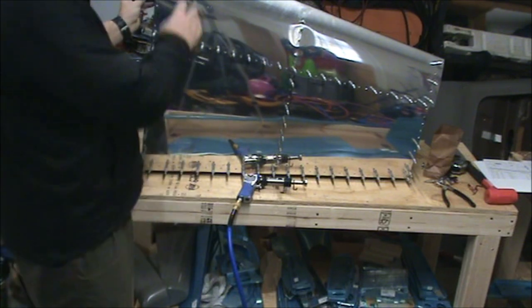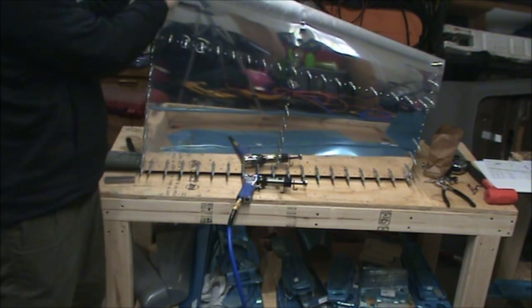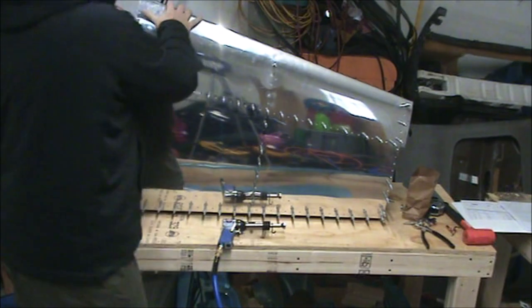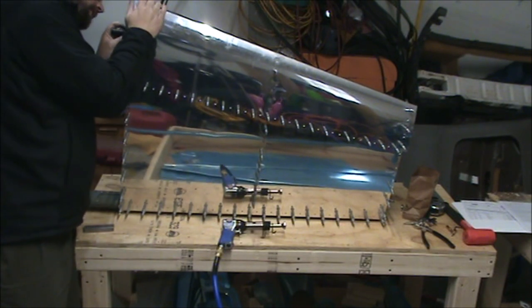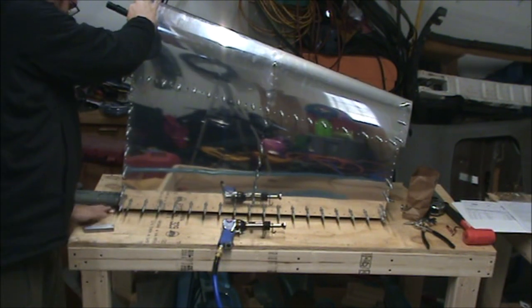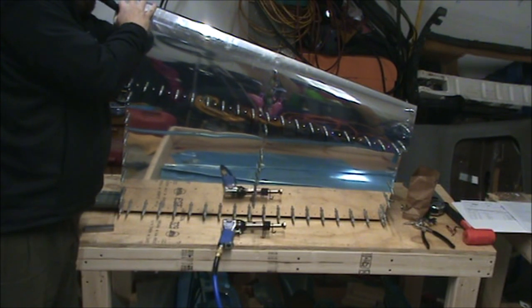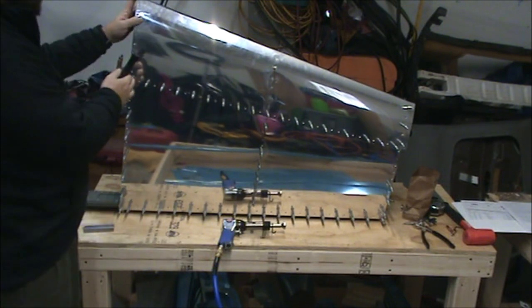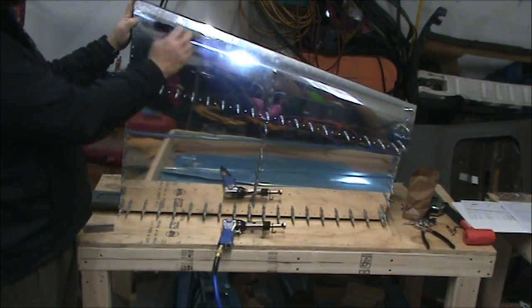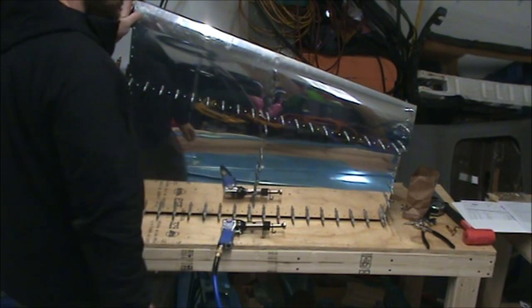This is probably just off screen since I have this standing up. We'll adjust it up here just a little bit. What you've missed me doing between each rivet set, probably because I was a little bit too low on the camera, is looking in there, making sure the rivet's set correctly and putting a rivet gauge on there, making sure they're not under or over driven, because once you close this thing up, you'd have to drill out all these rivets to get back in there to fix one of those rivets. So you want to make sure they are right before you continue on.